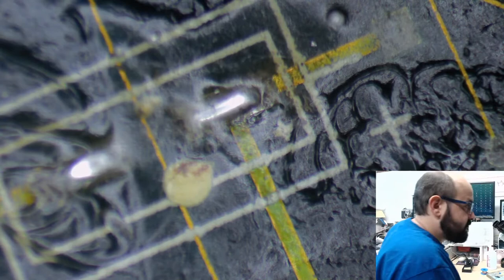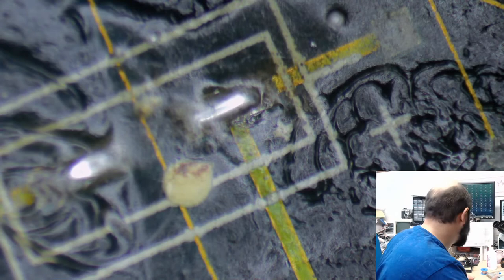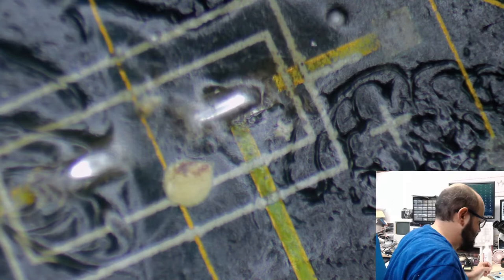I mentioned my SE30 is bootlooped. Try resetting the memory in your SE30 and reseating the ROM. If that doesn't work, you might have some traces or capacitor issues. Has the machine been recapped? And if it has not, you know exactly what I'm going to suggest you do.